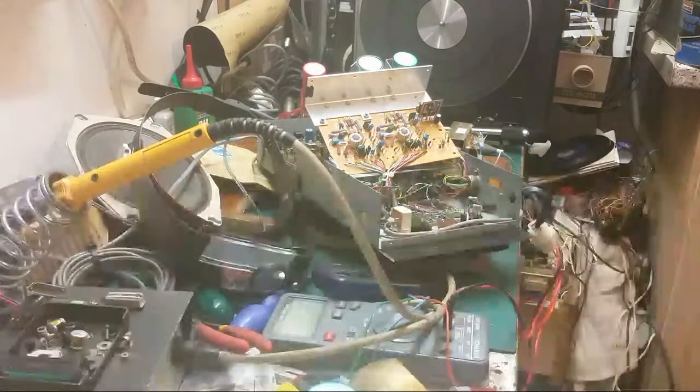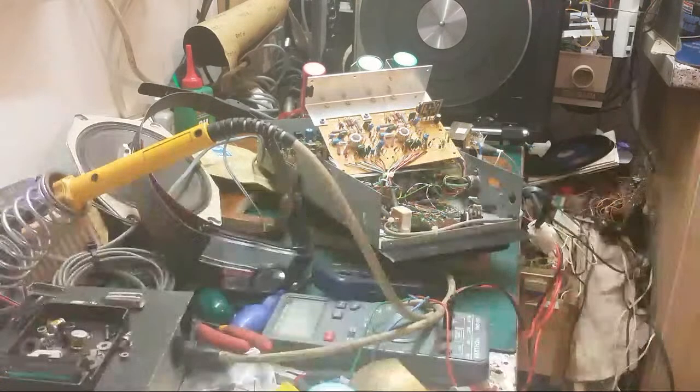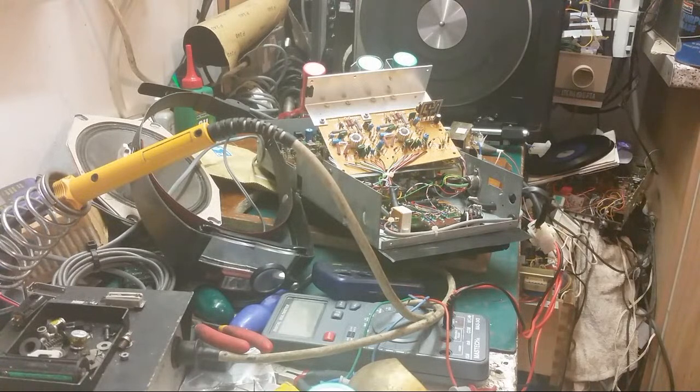Well, if you can't manage it, Steve, next time you come, bring it with you. I'll do it while you wait, and put some new thermal paste on. It could be just that. That one I've got in the dining room was doing it. When you turned it on, it would freeze after about 5 minutes or something, sometimes 10. But on the third boot up, it would stay on and run forever. Anyway, I took the CPU out, blew on the CPU pins and cleaned them a little bit because there was thermal paste on them, managed to get it off, put new thermal paste on the top of the chip and put everything back together, and I've not had a problem with it since.